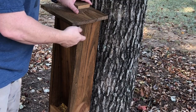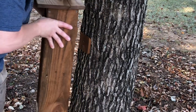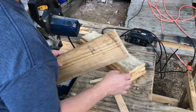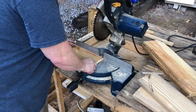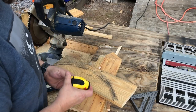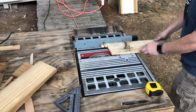A simple deer feeder like this, made out of pallet wood and held to the tree with a french cleat. This is pallet wood that's about the same size. First thing I'm gonna do is go through and cut all the ends off — I need four boards the same width, gonna rip them down to five and a quarter.